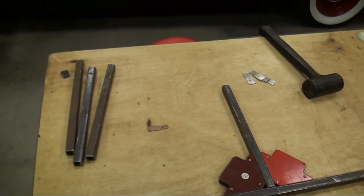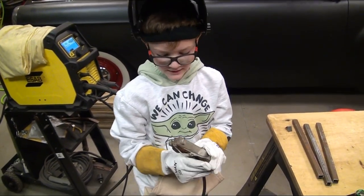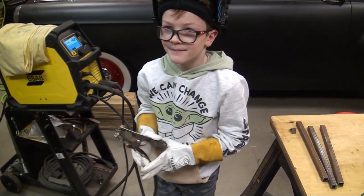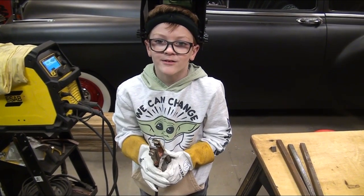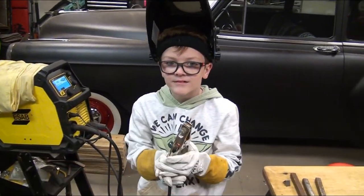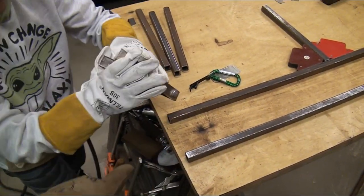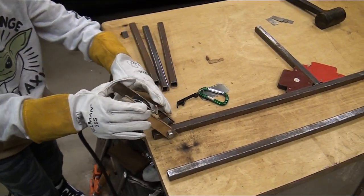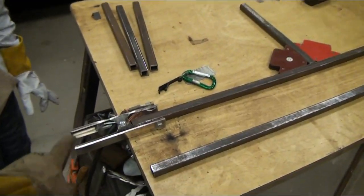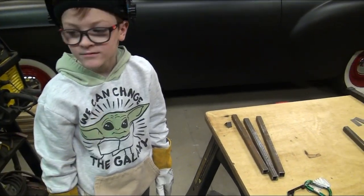We're going to weld a little bit. This is the clip for the welder and we're going to be clipping it onto this. Electric welders like a MIG or a TIG work off electricity and create a circuit. This is the ground clamp. You have to clamp it and have a good clean ground so it's got to be on bare metal — if there was paint we would scratch it off. We got it clamped, and that way anything we weld along here will complete the circuit. If we try to weld without it, there's not a complete circuit loop and it won't work.